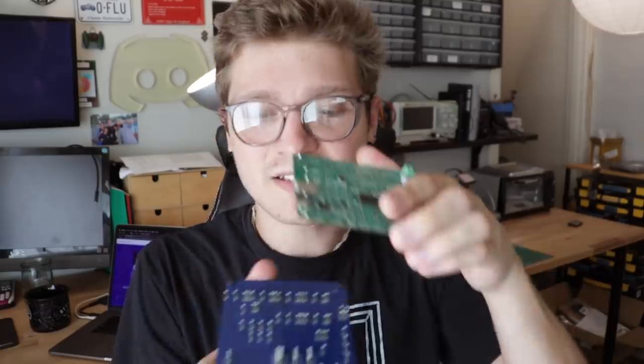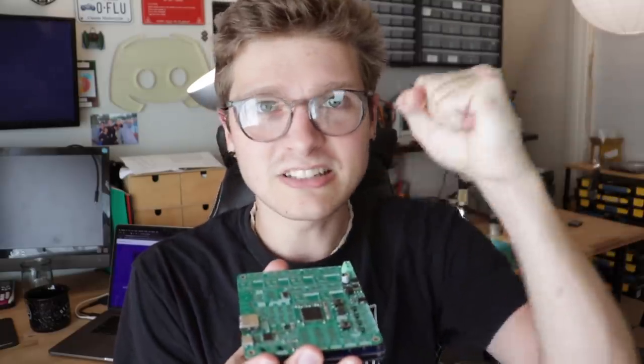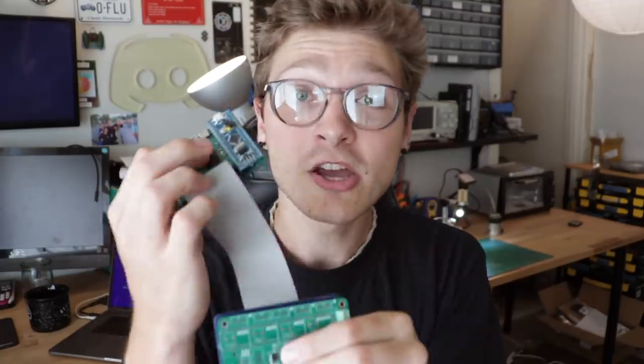So the first thing that will happen is someone will take a new motherboard to be tested, place it in the jig, pull down a little lever thing that presses it in, and presses go. At that point, the Raspberry Pi will flash my test firmware that goes onto the target using the blue pill, which is programmed as a Blackmagic probe.